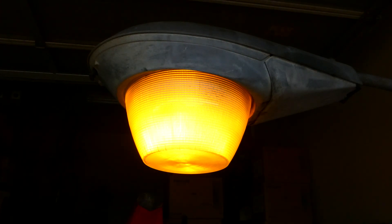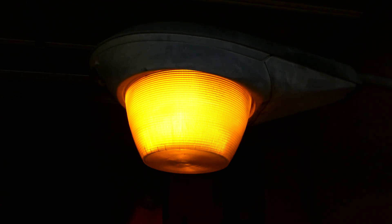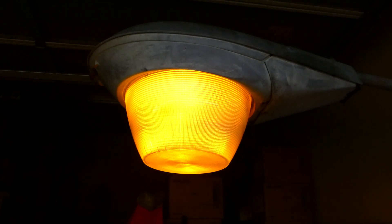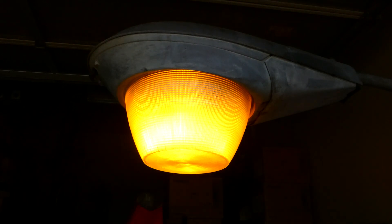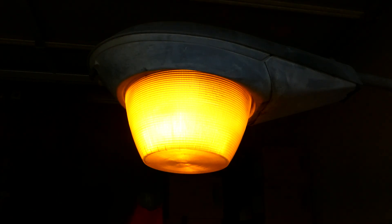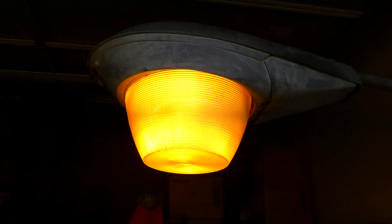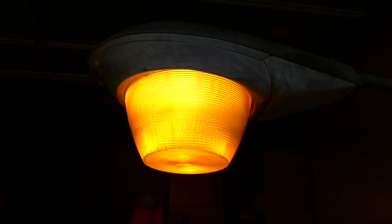That was a really interesting startup. There was zero of the typical white and bluish colored phases you'd get in a standard HPS lamp made before 2018 or 2019 or so, whenever they started really lowering the mercury content in these bulbs, because now new HPS lamps are rather boring — they kind of stay orange from start to finish. There were no phases like older ones that go clear mercury-colored, then more of a DX mercury, and then finally go orange.